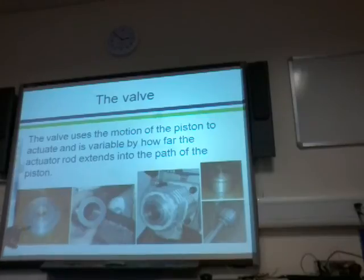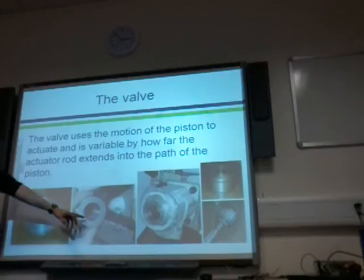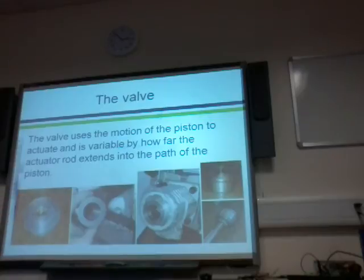These are my three main components. This end cap and that end cap are the same — that one's just got a bigger hole than this one for the steam to go through. This hole is actually to locate the spring which returns the valve. This is the main valve body just after it's been cut. After that I need to face off the end of it just to make it smooth, and then obviously my piston on the other end.